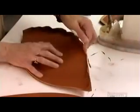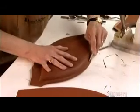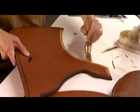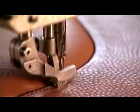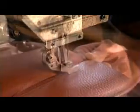Next, she seals the front edges and then crimps them together, the way a baker crimps the edges of a pie. She pulls the leather tight from the backside and paints glue onto the fatter rim. Then she brushes glue onto the flap and presses the knee pad and flap together so the glue sticks. She hammers them to strengthen the bond. Then stitches them together along that glue line using a big industrial sewing machine.